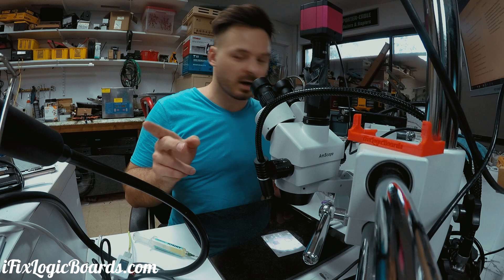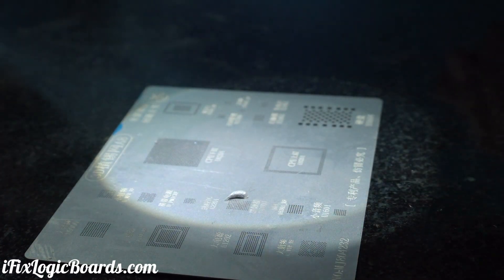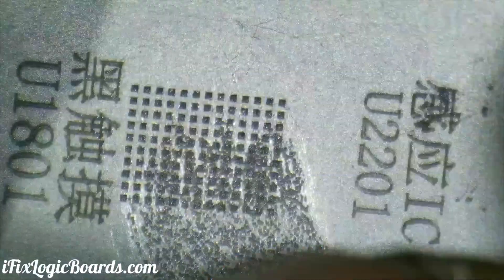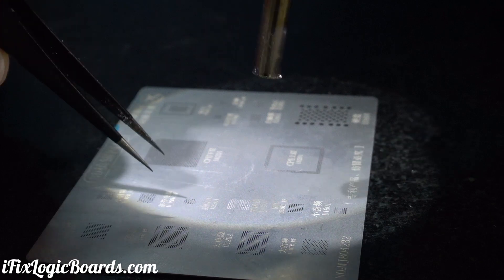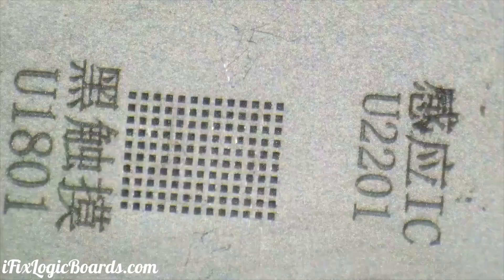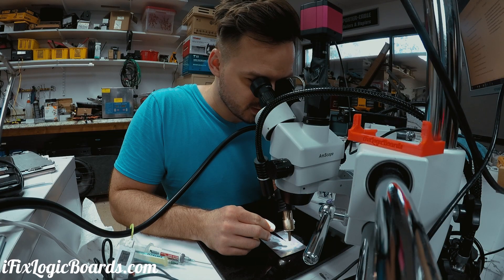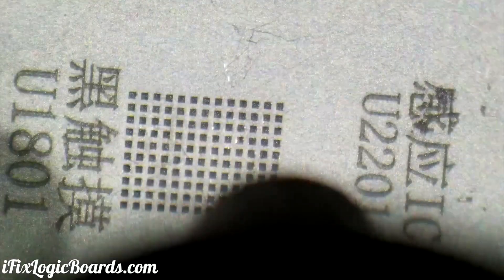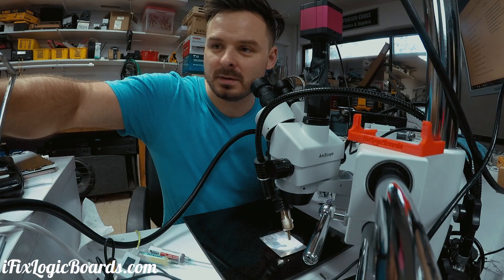Drying it out — I'm running the hot air at 258, that's just a random number. You can see the paste is pretty thick, that's good. I'm just gonna use my finger and slowly apply the heat. Mechanic would already start melting at 250, this one needs more. Let's do 300. Okay I'm getting some action but still not what I'm looking for. Let's do 330.